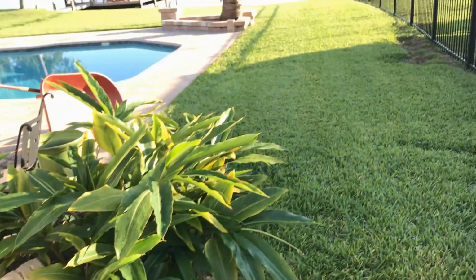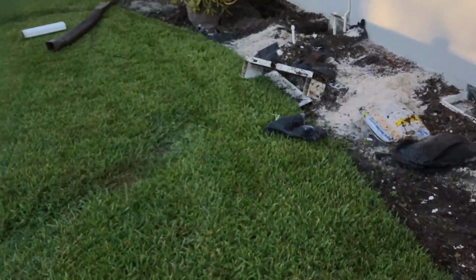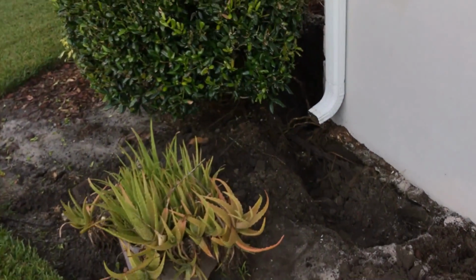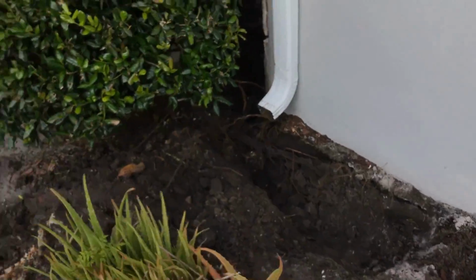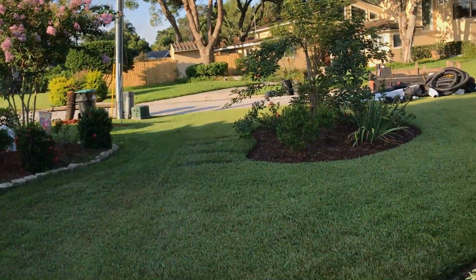Okay, so we've already decided to modify some of this. We were going to send it out and through the seawall, but I think it's better if we bring this line along this direction up to the front. The reason being is there's so much water coming off of the roof here that I want to collect it right away. So we'll put the sump pit up here at the corner, and we'll pipe that right out to the street and put it at a pop-up at the curb.